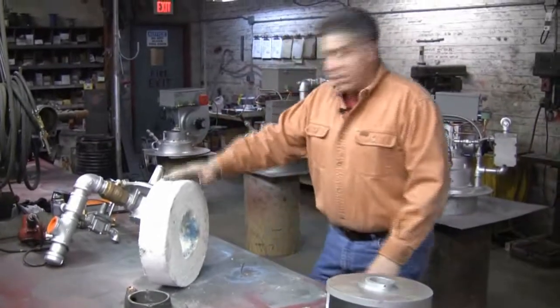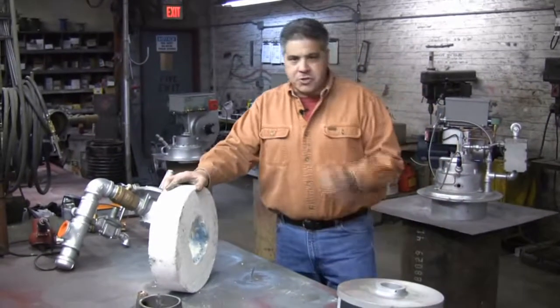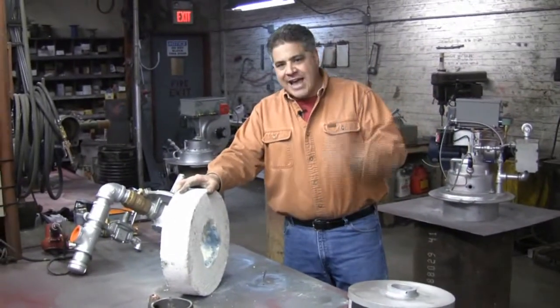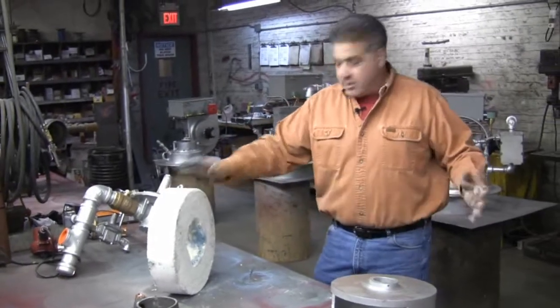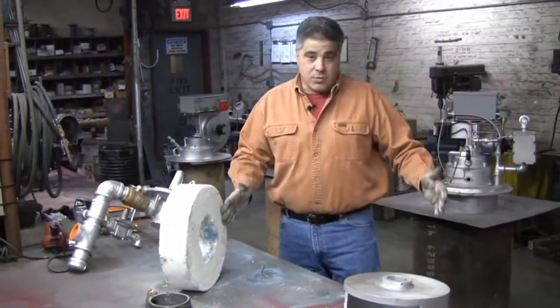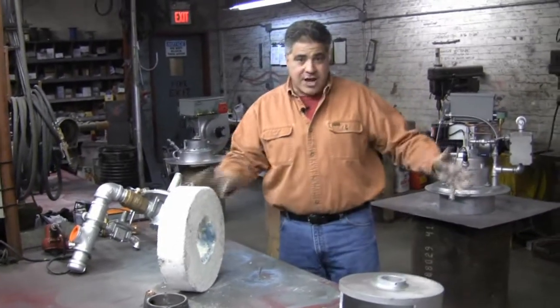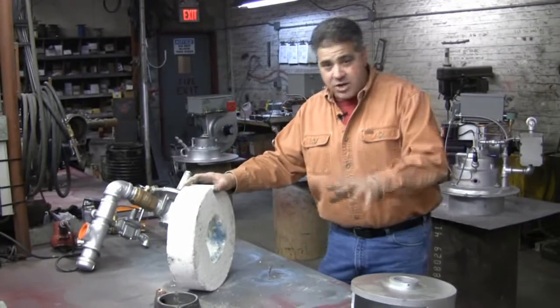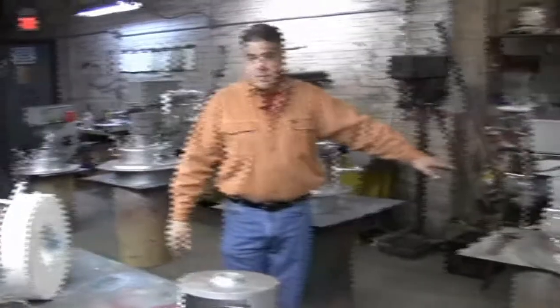These refractories will glow red hot, which atomizes the fuel better, which gives you a more efficient burn. We achieve lower stack temperatures because we are gaining efficiency in the burn cycle of the fuel being used. Because we create 6 inches of back pressure in a forward combustion chamber, our stack temperatures end up being approximately 450 degrees on a 2.8 million BTU burner.